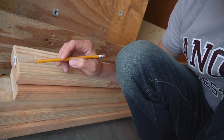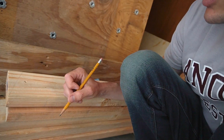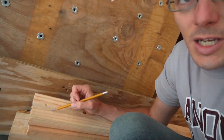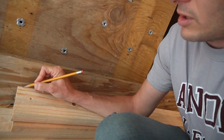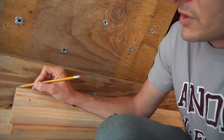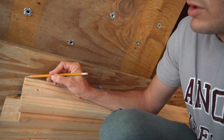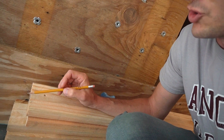The piece on each end, so that it will rest at a 15-degree angle. There is a great way to do that if you don't have a compass, but there is another way using math — using trigonometry. The trigonometry of a right angle: if you want to calculate the distance of this side, all you have to do is know your angle, which we know is going to be 15 degrees, and your length, which we know in dimensional lumber is three and a half inches.